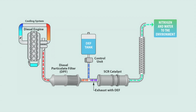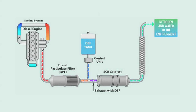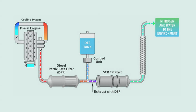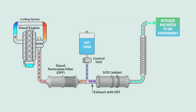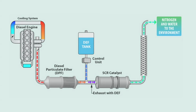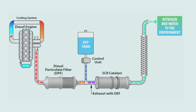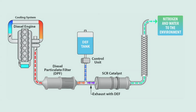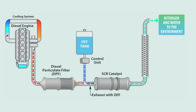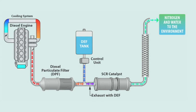Currently, International trucks with the MaxxForce 7 or the MaxxForce DT engines do not require SCR systems to be 2010 compliant. So for now, the diesel fuel tank is the only one you'll need to use. In the future, SCR will be added to our medium-duty engines. This will be an additional tank that will need to be kept filled with diesel exhaust fluid, or DEF.